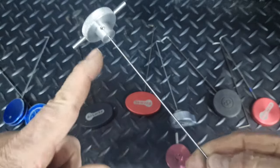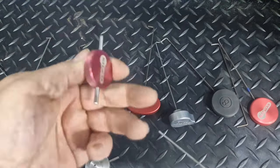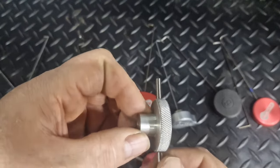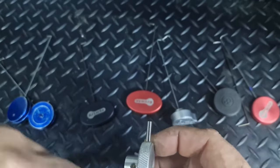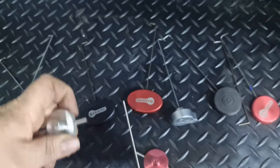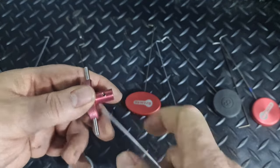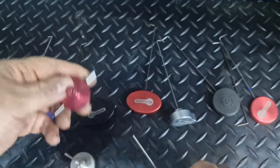And that would be the same with the GJ version of it — you put the wire in when you do the allen screw up. The downside is, this one had a decent-sized allen screw so you could really get a good purchase on it to tighten it up, but it would still come loose and then twist. The GJ one, the allen screw is probably a bit too small, so the allen key would just start spinning — either the allen key was stripping or the allen screw was stripping. So this was good, but not so good.